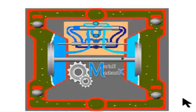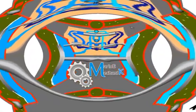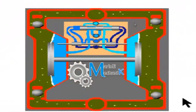Now let's concentrate on the pilot side. Before going to that, as the diaphragm is being pushed, the air on the other side is getting trapped. It has to be drained, so the same passage is used for draining. Now we can trace this passage and you can see that it is connected to the drain of the main air. So this is the main air inlet and this is the main air drain. The air over here drains out. That's why you get a sound when the pump is operating: shuck, shuck, shuck. That's the reason.